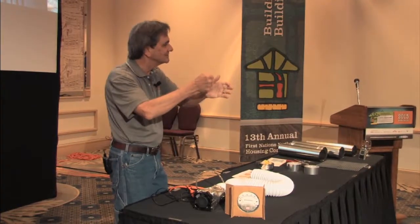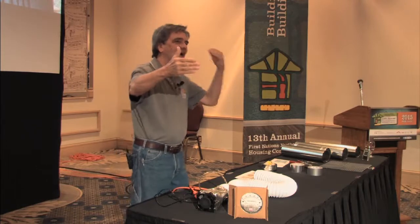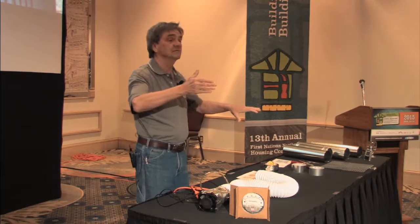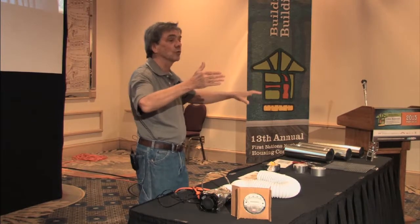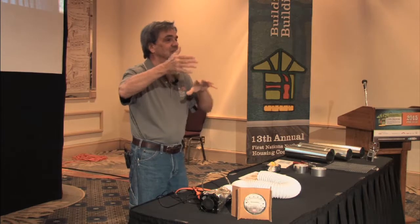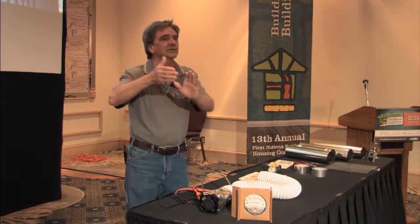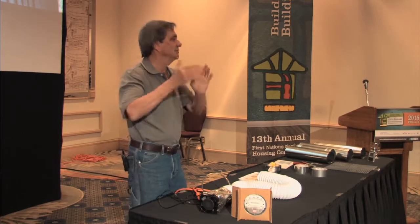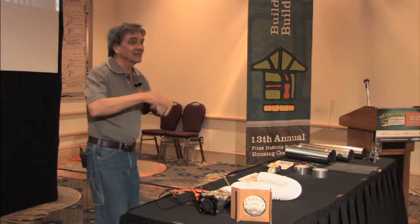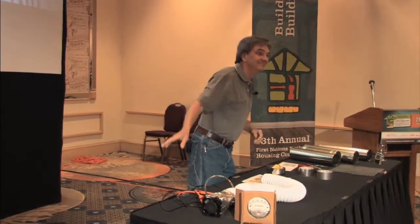So either we drop the humidity with ventilation, dehumidifiers or whatever, or we raise the temperature of the surface. But as long as you leave it cold with high humidity, you get water. When you get water that doesn't go away, you get mold. And when you get mold, you get sick. It's that simple. So we either wipe it down all the time and live with it so that it can't grow mold. Well, that's too hard to do in the corners and nooks and crannies of the house. And so we try to drop the humidity.